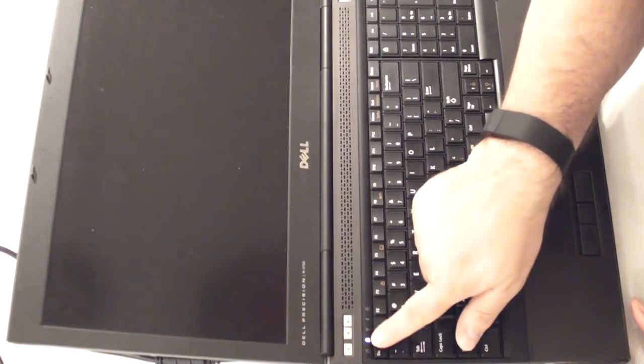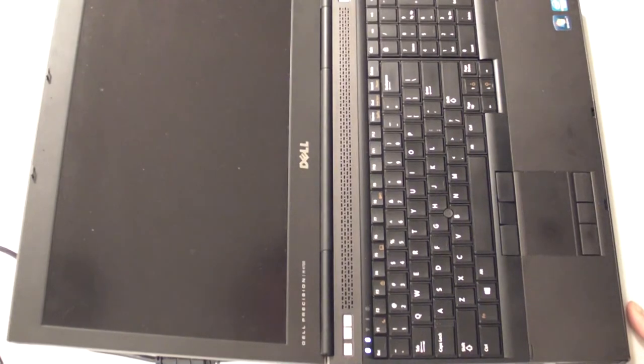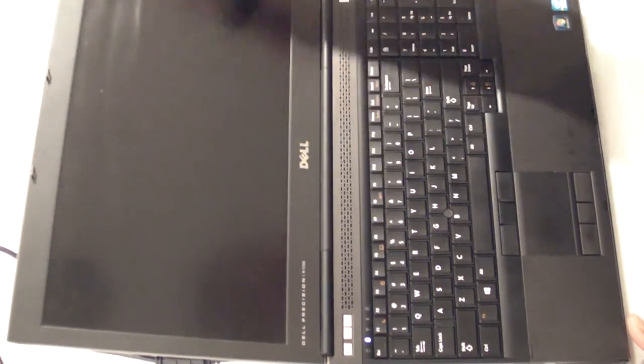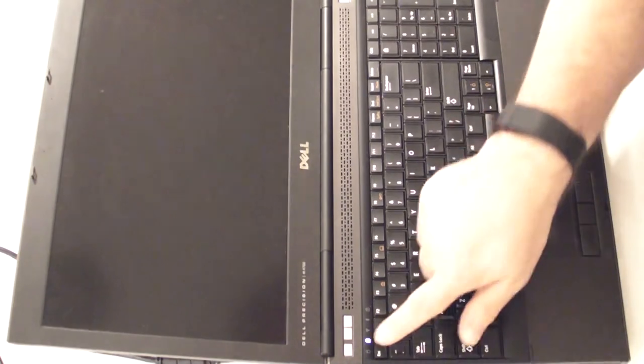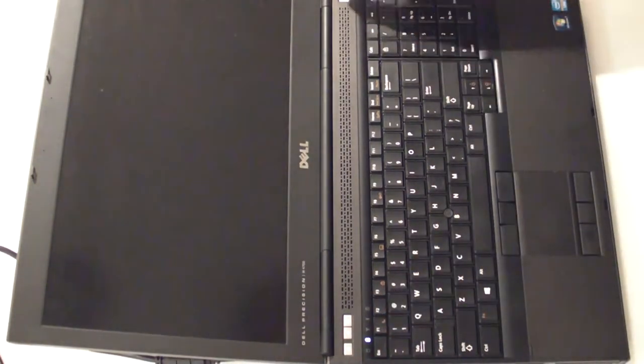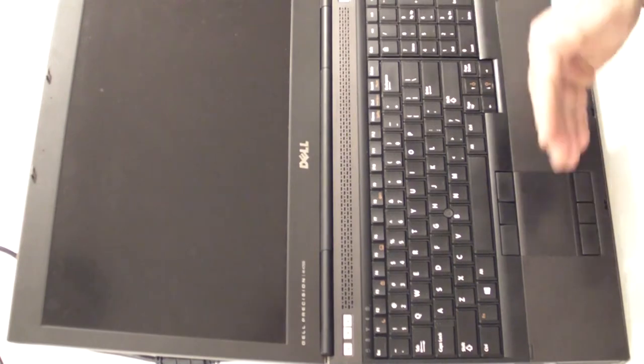We have the battery light on, so let's push the power button. Okay, that's good. And that's it. Nothing else happens. The little DVD makes a little seeking sound, which is kind of normal for when they're initially powered up. And that's it. There's absolutely nothing going on with this machine. I have lights illuminated here. That's nice. And if I press the power button, the fan speeds up, there's a little beep, and then it shuts down.